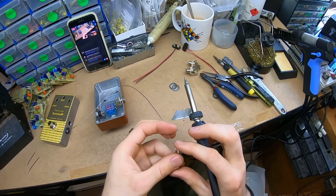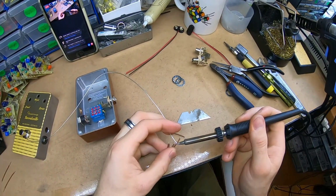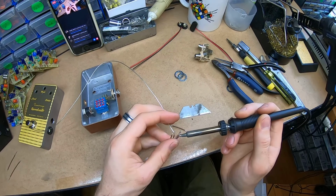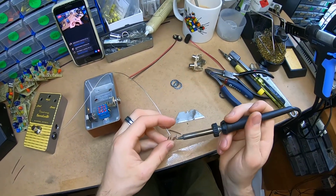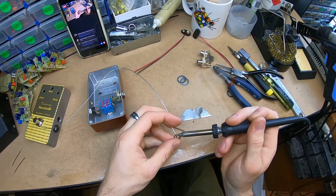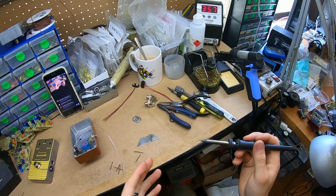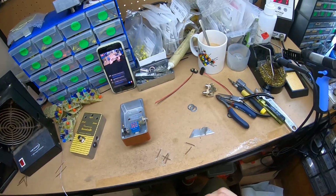It's good to work on your tinning technique in a way that makes best use of the flux and not constantly adding more. What I would like to do is get the iron at the front and the solder coming in from somewhere else so the heat will pull it through rather than trying to paste it onto the copper. And usually if I've got a blob, I try not to wipe too much. I make use of the blob. If I've got a blob building up, that means I probably have to change what I'm doing, unless, yeah, there's probably a tidier way I could have been soldering.